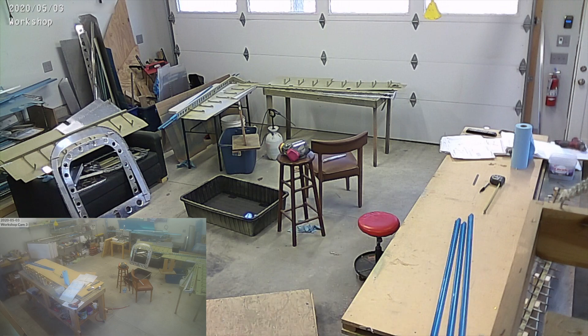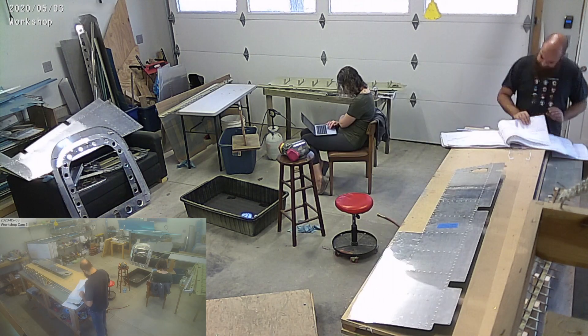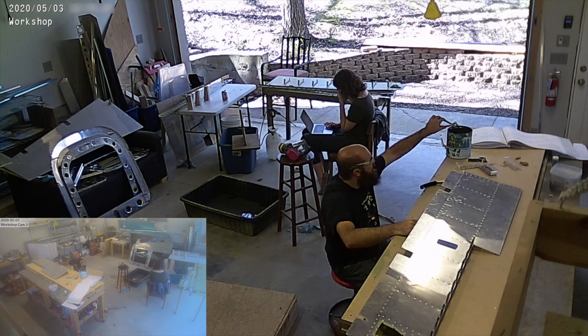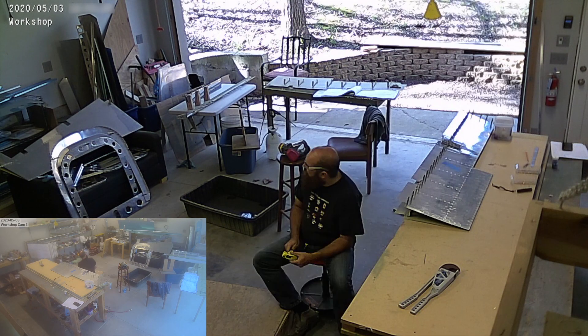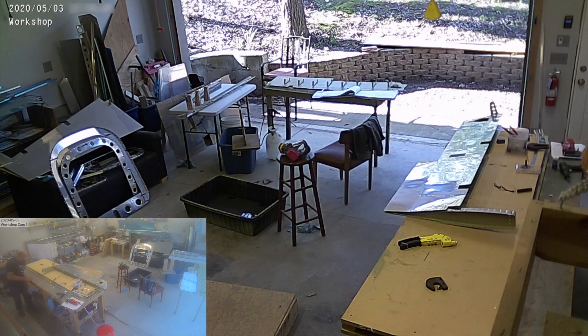You see the bulkheads that I put together on the back — they're just Cleco'd right now. And these are the J-channel stringers that stiffen the fuselage. You'll see a little later we actually put those together. And here we're riveting that elevator, riveting the skins to the spars as you can see, and the spars to the ribs were in there.